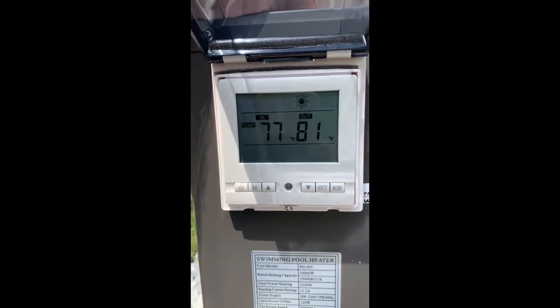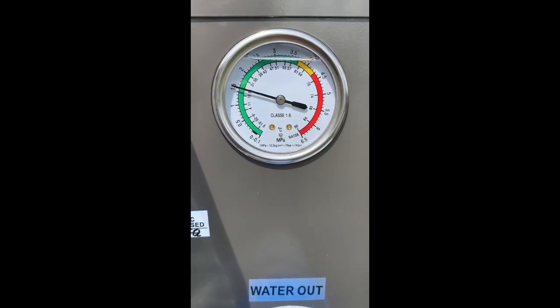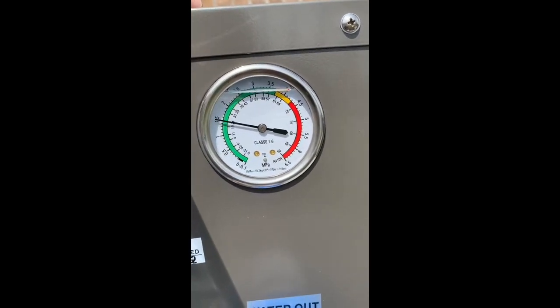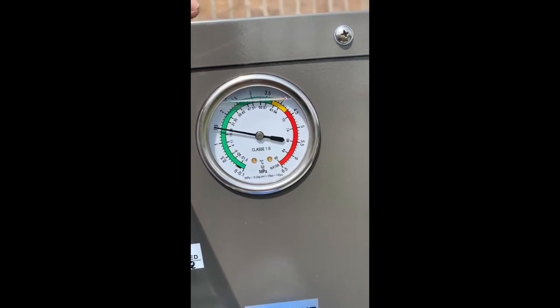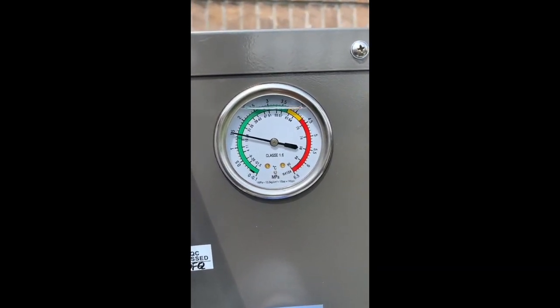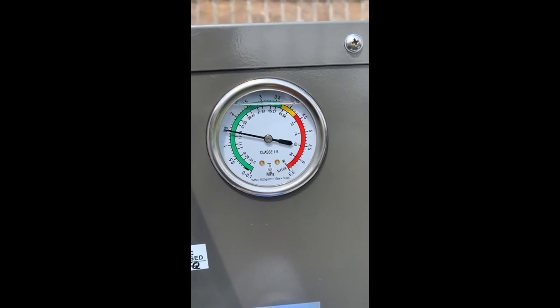Flow is established. The fan came on already — it takes a few seconds after the fan for the compressor to come on. Our system pressure is down to 1.5, and once the compressor kicks in that's going to climb up. Now, this 1.5 is very relative — it's a warm day now. If it were frigid winter, it may be below 1. It's a very compressible gas in there, so it moves up and down. If you were in Arizona, it might start up at 2. Don't worry too much about the initial value — just the difference from not running to running is what makes the difference.